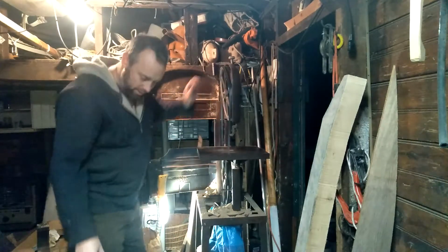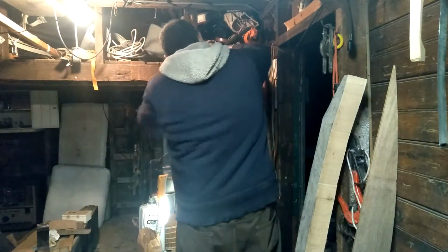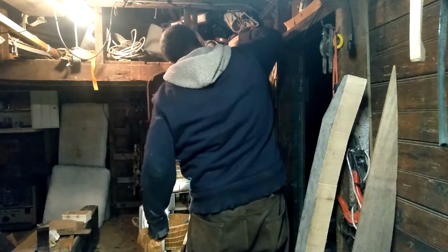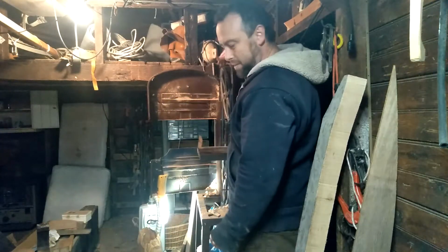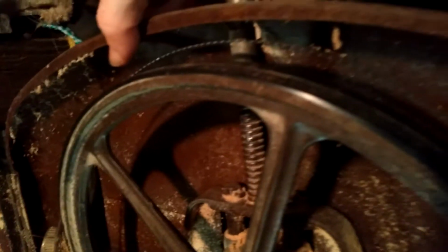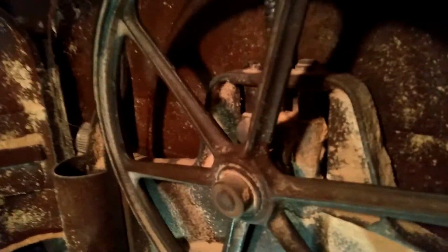all right, so the next thing I need to do is start leveling out. That's what was wrong. So there's a screw on the top. The screw had some tension on it. And you can see the screw adjusts the tension on that wheel. You can see the wheel is sort of suspended on these rods here.